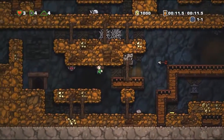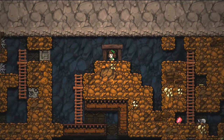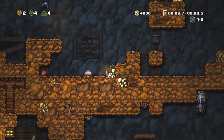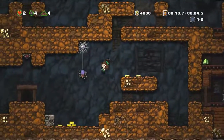I've got these boards laid out to join up into a panel. I've got them lined up on the ends. I'm going to make some marks across them and then cut a slot at each one of those points with a biscuit joiner. Now each one of those marks has a slot cut in it. There's a biscuit that's going to go into each one of those to lock the two pieces together and keep them aligned vertically. I'm also going to add tons of glue to all of this surface so that everything will glue up into a single panel.